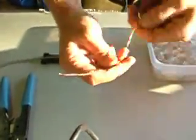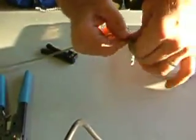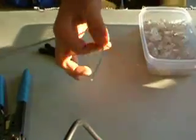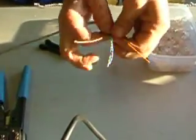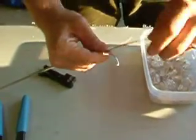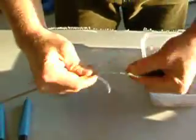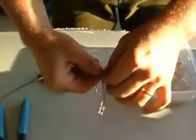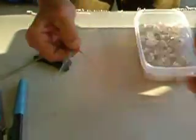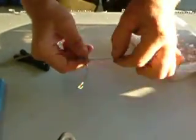Move the orange wires to the left, brown wires to the right, leave the other two. Untwist the white-orange, pull them tight so they're nice and straight. Pinch down with your right hand, thumb and forefinger, to hold these wires. Then move the green over because the white-green is coming next. Untwist the white-green, move the green over, straighten out the green one, and pull it in with the ones you just did. Straighten out that green one, leave it to the side — the blue one is coming in next.